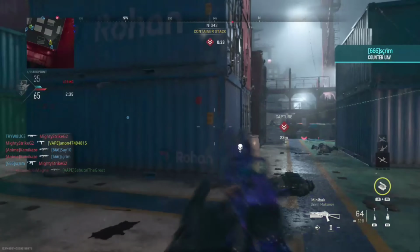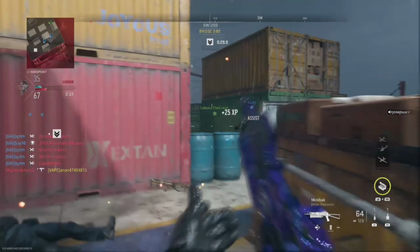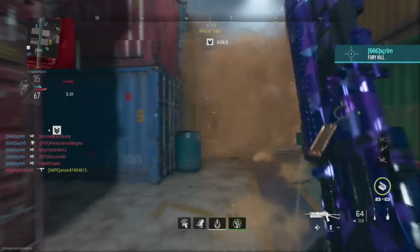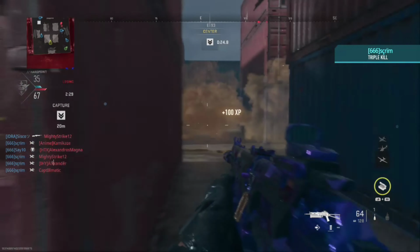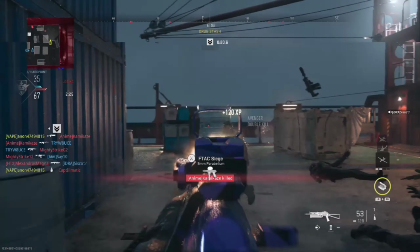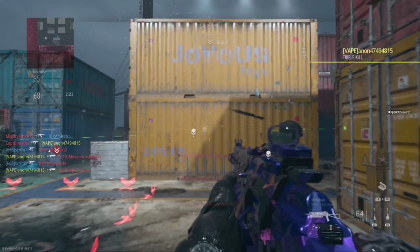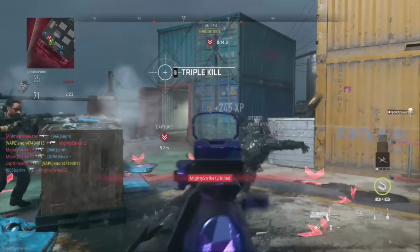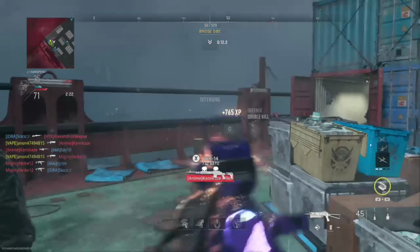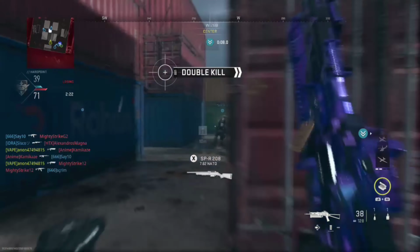But anyways, the more common variant is chambered for the 9mm Makarov round, and this provides a gun with relatively low recoil, as 9 Makarov is really just a spicier .380 ACP. Plus, a cool little bonus that the 9 Makarov gives the Bison is that, due to its lower power, it doesn't send the bolt fully rearwards to slam into the receiver. It only travels a little ways past the cartridge till the spring causes it to stop and begins sending it forward. By the bolt doing this, it adds to the recoil reduction of the gun.